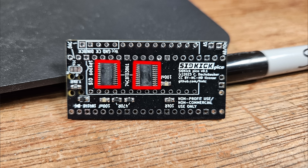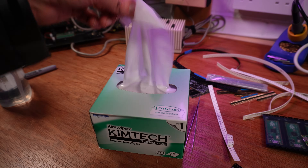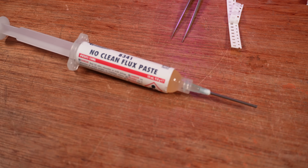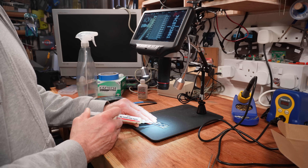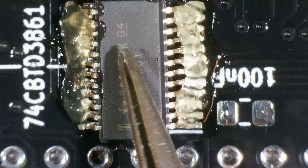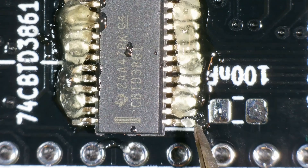All the parts are here now. I'm going to go through this build step by step as there's a correct order to put this together. First, these two chips — the level shifters that allow the 3.3 volt Pico to interface with the 5 volt workings of the C64. Before soldering, it's a good idea to clean the board with IPA to remove any contaminants and oxidization. I was recently gifted some MG Chemicals flux paste, and I'll install the first chip with this flux and the second with my old Topnik liquid flux for comparison. With the chip roughly in place, I apply some flux to each row of legs — though the flux is so thick and sticky it makes it difficult to see the alignment of the chip on the pads.